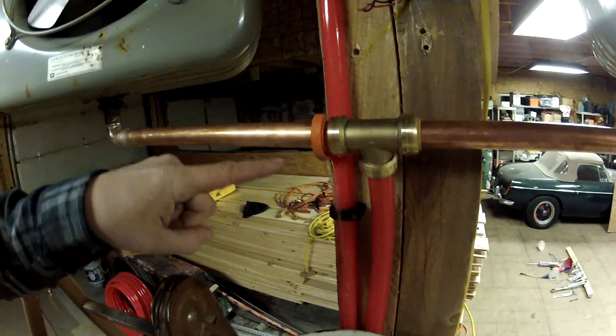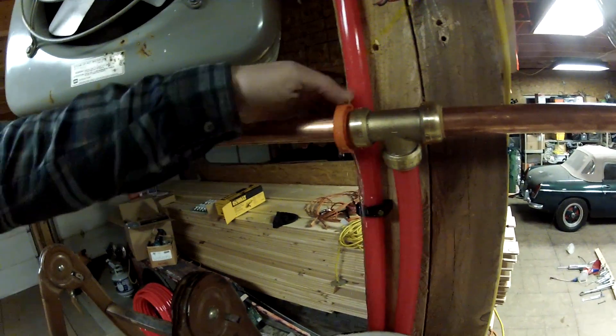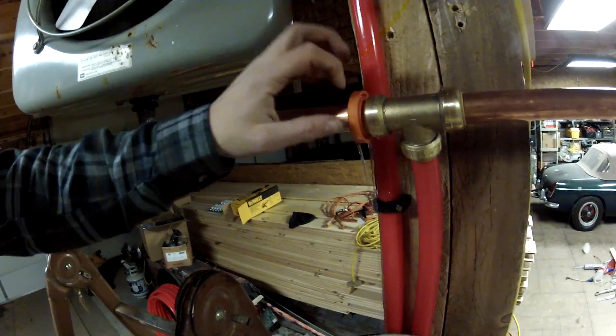First thing you do is break a connection. I just push — this is my removal tool. I just open it up a little bit, and so basically all the water from the Modines is dripping down to here and it's going to drain, so that these are going to be empty when I go to actually take them down.